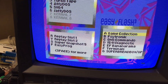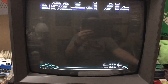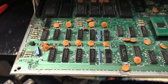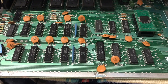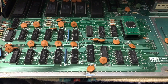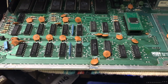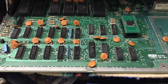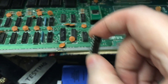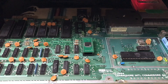There's the good old Ghost and Goblins — I think we might have a winner here. The interesting thing about this board is these MOS 7708 chips, the memory multiplexers — they're actually copies of 74LS257 chips — and they're in working condition, which is kind of amazing because I see a failure rate of at least 50% or higher on these chips. Before I call this one done I might remove those, install sockets, and put a set of 74LS257 chips in their place since I have quite a lot of them.